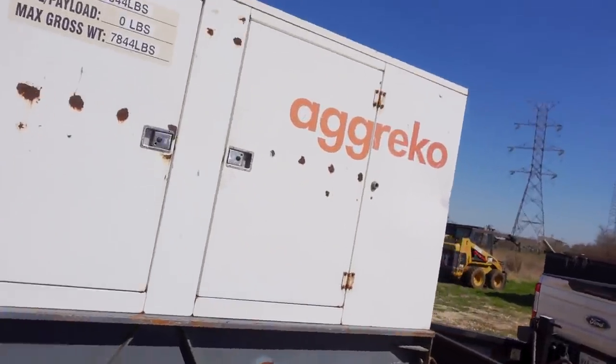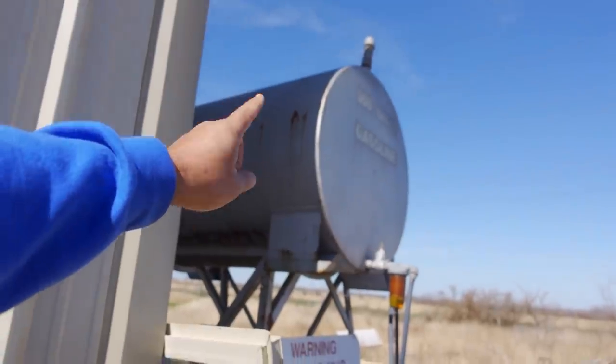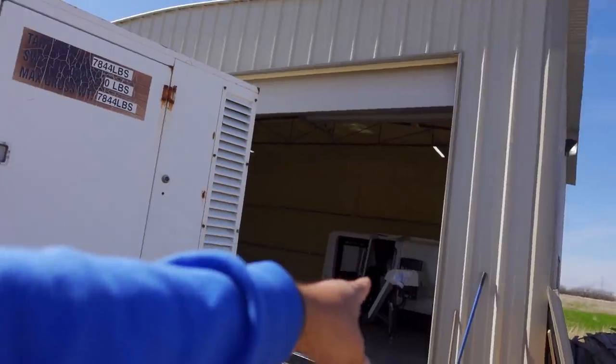The lathe was dropped off yesterday. Since I don't have power yet, I got a diesel generator — it'll give me enough power for that machine until the power company sets up my three-phase. This thing runs on diesel and at max load it's about eight gallons an hour. I have a 500-gallon diesel tank right here, so I'm putting the generator right here and running cables to the lathe.